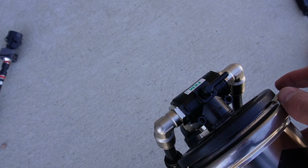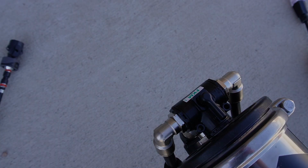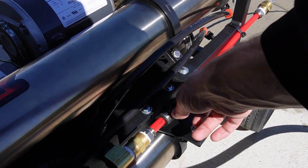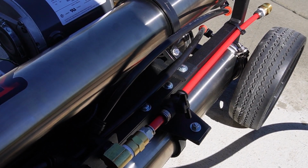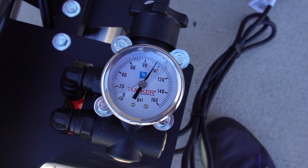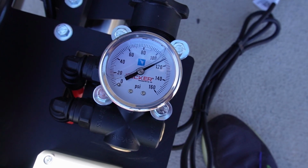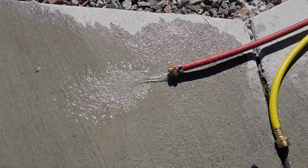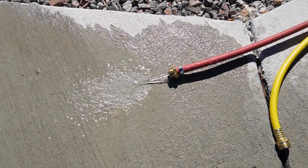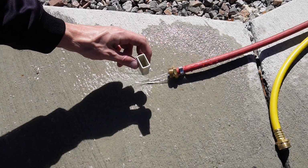Set the RODI toggle to the downward position, sending water out of the RO-only outlet. Next, close the bypass valve to engage the RO and move water through the rest of the system. You will then see the pressure on the cart increase. Then, with your handheld TDS meter, take a reading of the water coming out of your RO-only port. Check to see if it is reducing the incoming TDS by 90% or higher.